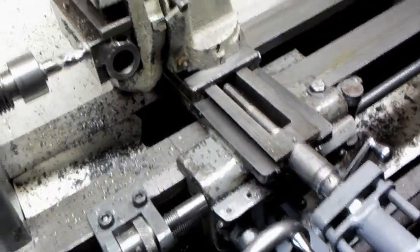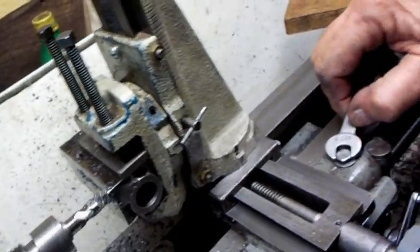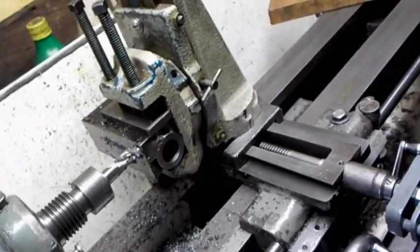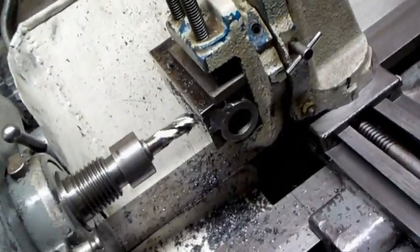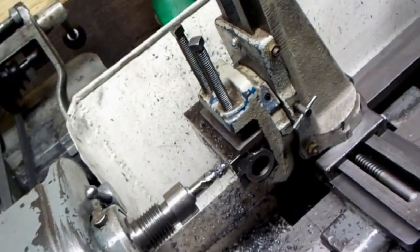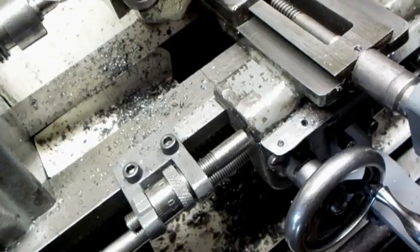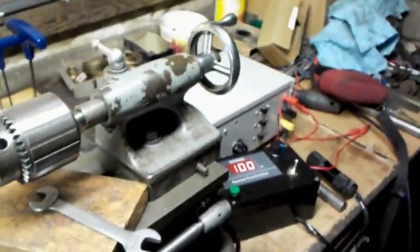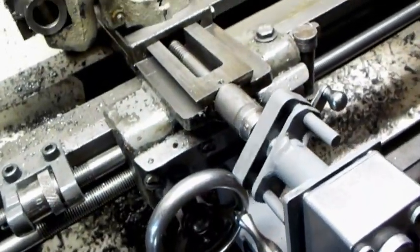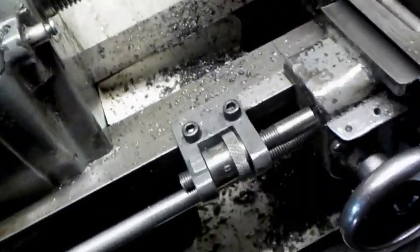Here we're coming back. Basically what I do is I'll just undo the carriage lock and then move the carriage away from the cutter, then turn the lathe off — saves on hydro a little bit. Every cent counts these days apparently. And of course I'll speed this up to 100% when bringing it back. It'll take a little while to get back, but when it does then it'll feed in the last 10 thou.